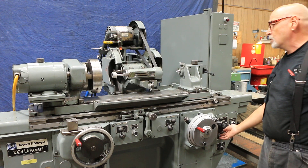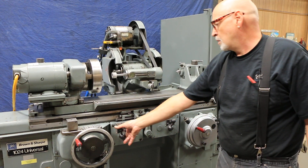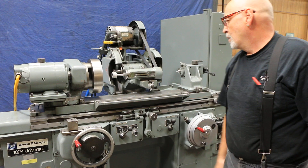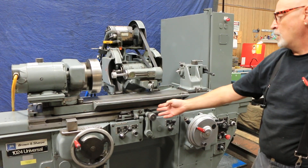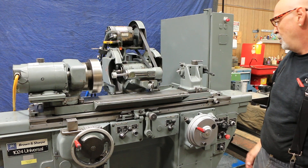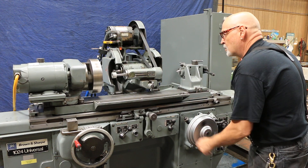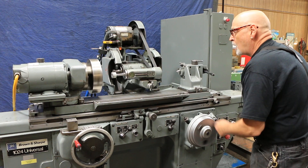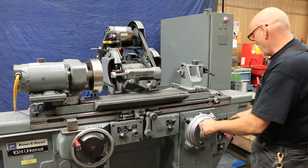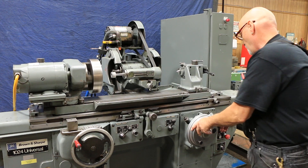Let me shut it off for a moment. I'll start the machine just to make sure everything is okay. We'll start the table. A lot of times guys want to do something like this — this reciprocation in and out of the hole. And with this machine, you can turn it clockwise, but my wheel slide is going backwards because I'm in the internal mode here.